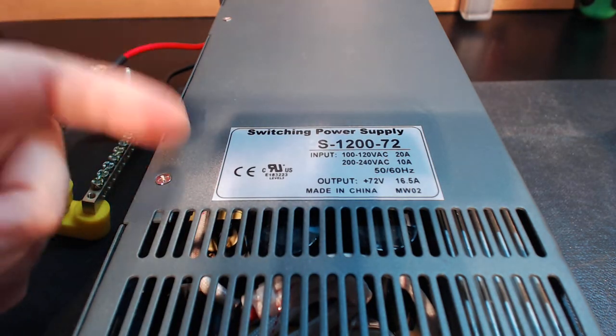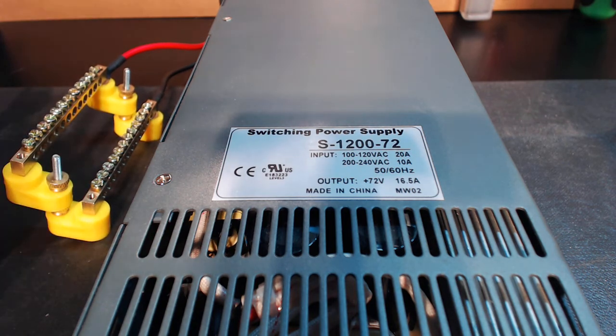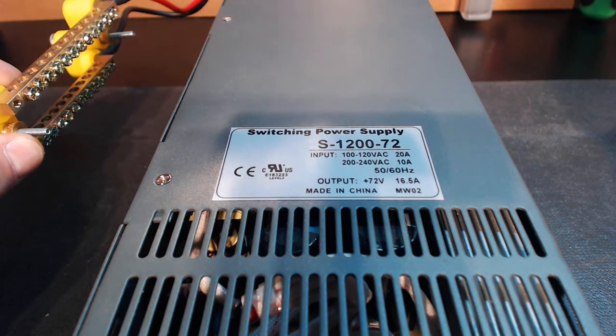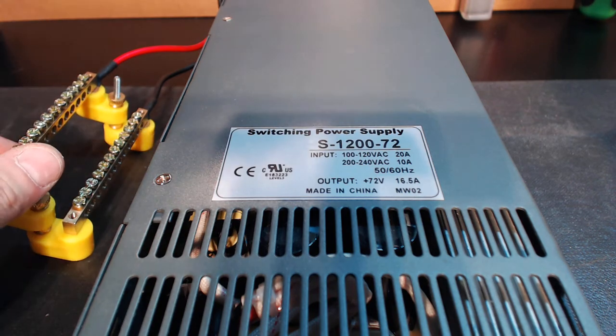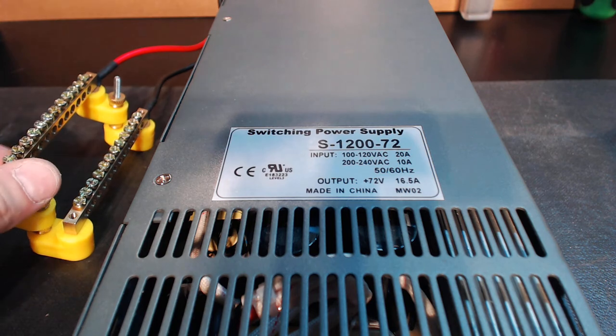Until you've had one of these terminal blocks mounted in a position that's optimal for your system — a lot of guys like to mount their power supplies outside of the enclosure so they're not generating as much heat inside. You can have the wiring with the terminal blocks mounted inside and the power supply outside. That way you can clean or service your unit whenever you choose, and you're not building that ambient heat with the unit mounted inside the enclosure.